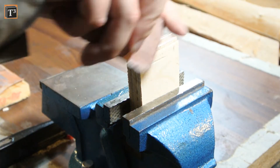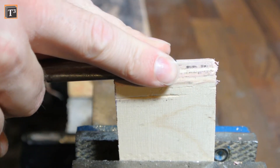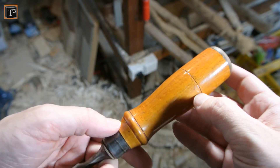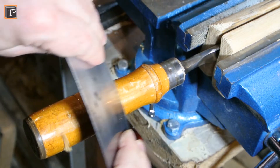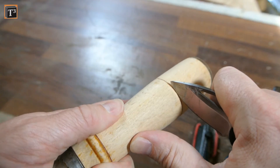For the inside I did the same with the remaining block of wood that I prepared. As the varnish on the handle had cracks and I didn't like it anyway, I started to give it a makeover. The easiest way to get the clear coat off is to use a scraper. I used a knife to clear the thin slots.